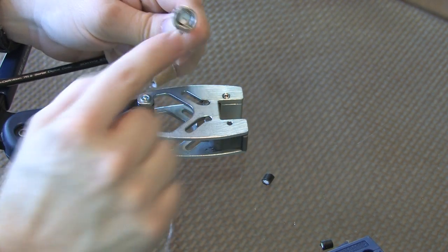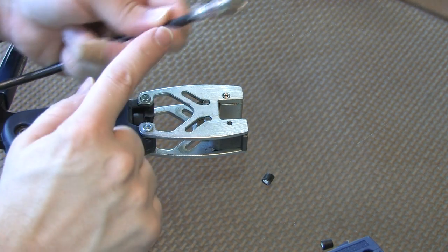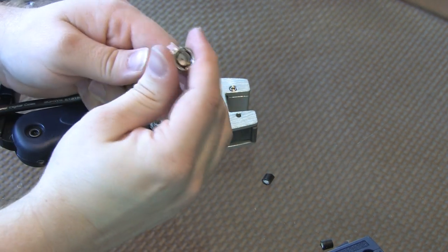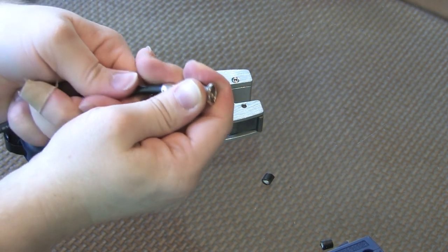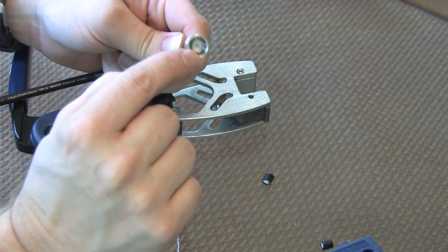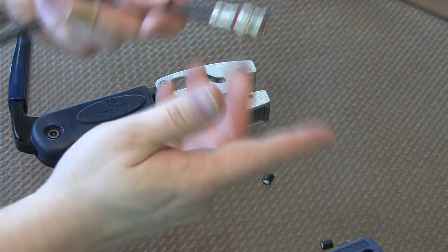If we take a look at this point, you'll see that there's still no pin showing through on the finished connector side, so I know I'm not in anywhere near far enough. I'm going to keep pushing. Once I've got it pushed as far in as it will go — this takes some strength — you'll see that now I have my pin showing through all the way, flush with the end of my BNC connector. So I know I'm in all the way.